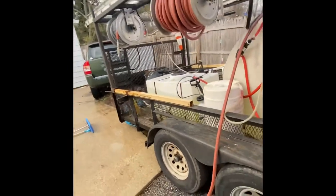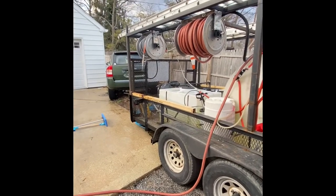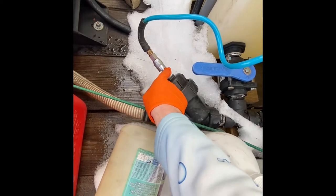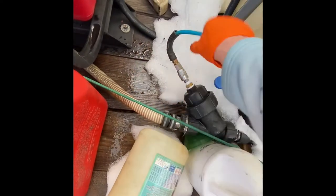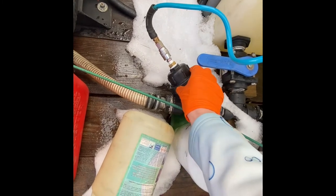So I recommend it. Super simple, doesn't require antifreeze, and all it requires is the air compressor and two pieces. So, yeah, I'll go over it with you really quick one more time. Air compressor, half inch reducer to quarter inch male air compressor fitting. Then you have a female air compressor fitting that goes back to your air compressor, and this goes into my banjo Y strainer.